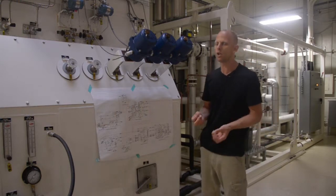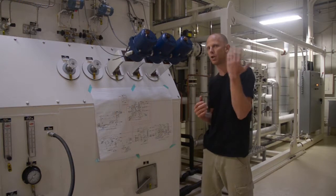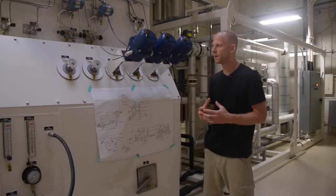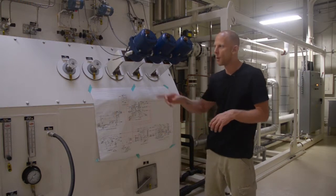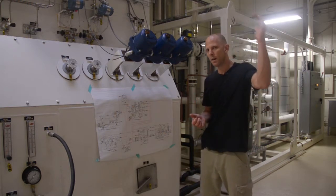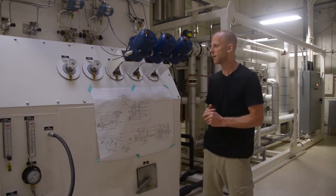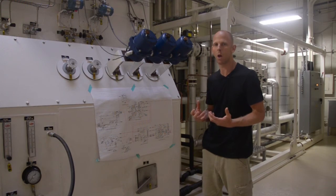Generally in our waste stream, we would like to have about 3.5% oxygen molecules or less. So if we're finding we've got 8% oxygen in our waste stream, we can open up our PL feed, this is in oxygen mode, and trap more oxygen, condense it, and reduce the loss of oxygen from our column, and that will help our purity.